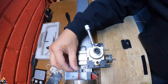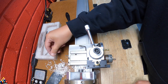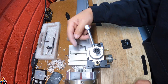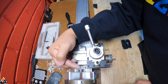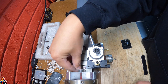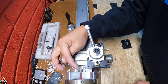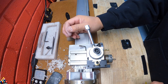What I noticed when they built this carbon shaft, they actually used a T34 also. I can tell by the way it's chipping. And they actually used it as the whole rod going all the way from inside the carbon itself and making the ferrule. And that's how it's mated. So for some reason, the bond between the T34 and the carbon inside was loose and it made that noise.